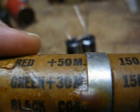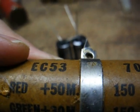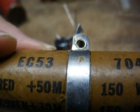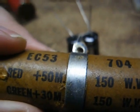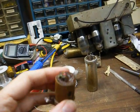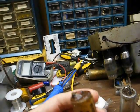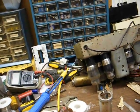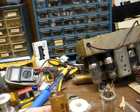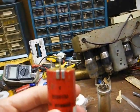When you install or replace capacitors — or any part — you want to make sure everything is securely insulated and securely mounted physically. The 33 microfarad on the left connects to the green lead (originally the 30 microfarad section), the 47 microfarad on the right connects to the red lead (originally the 50 microfarad section), and the black lead connects to your common ground. You can also unsolder the wires from the chassis and solder the new capacitors directly to tube socket terminals or terminal strips.